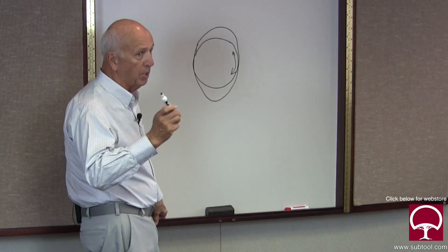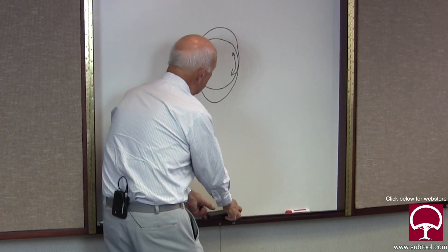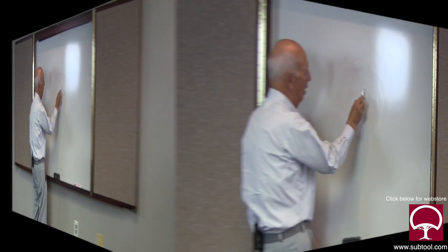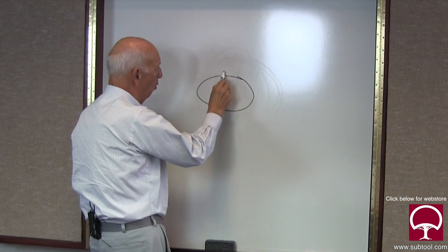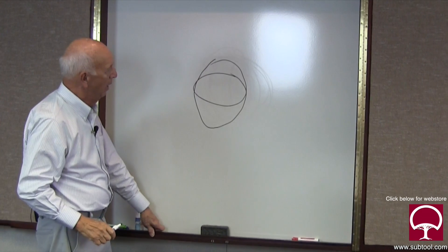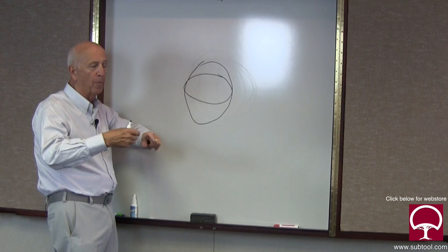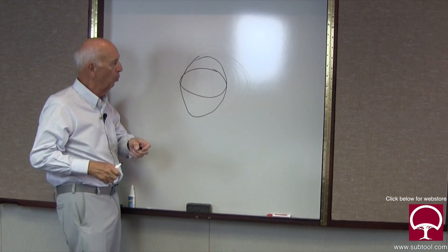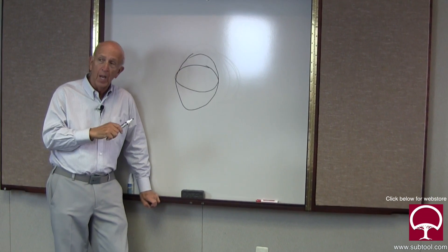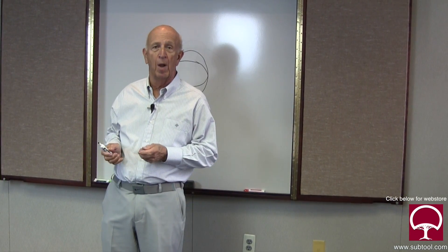Something's not round, but you're not going to know it. How would you know if it were out of round? The only way you would know — outside of checking for it — is if both were out of round. So if you had one that looked like this and another one that looked like this, again exaggerated, it's going to act like a cam. You'll hear it go thump thump thump thump; you'll feel it in your fingers when you're rotating it.